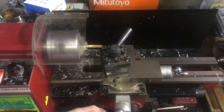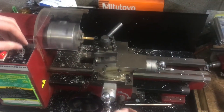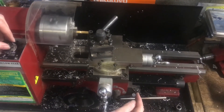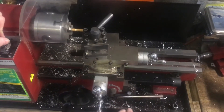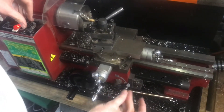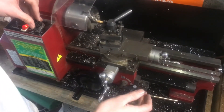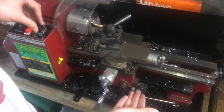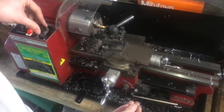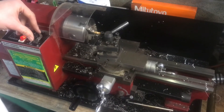I'll bring it out and just touch on my part so we can get a scratch pass. I'll slow it down a little bit because we need to hit the timing exactly right. I'm going to try to hit the one and engage the half nut lever at the one every time. I think there are symmetries within the dial and I might be able to pick up the same thread using several different positions, but I'm not exactly sure how the dial works. If you want to guarantee that you always hit the same threading line, you can always go on the same number — I always just hit the one.